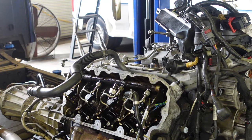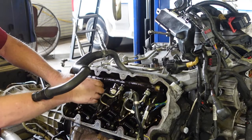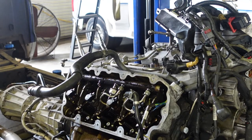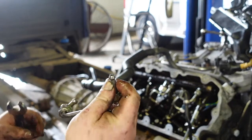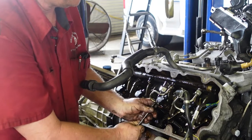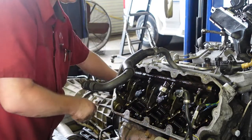Get the right size wrench here — I think it's a 17. It is a 17. Let's get our fuel tubes off here and inspect them real good. They tell you you really need to replace them if the ends are bubbled bad — the ends of these things bubble really bad, and they'll recess on one side and not give you a good seal, then you fill your crankcase up with fuel. So it's probably a good idea to go ahead and replace these. I could probably reuse them, but I really don't want any issues with this engine.